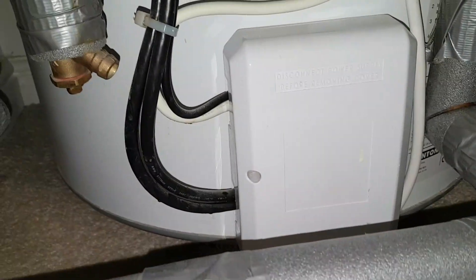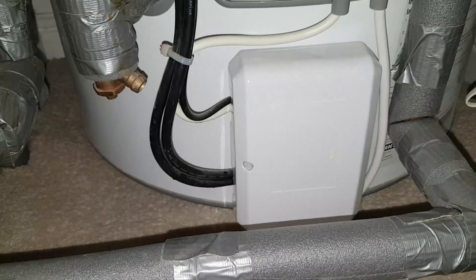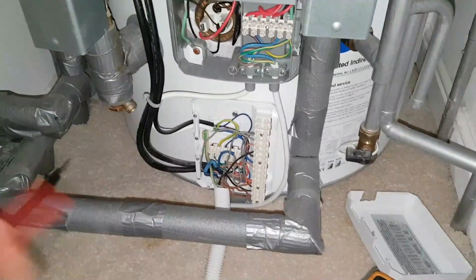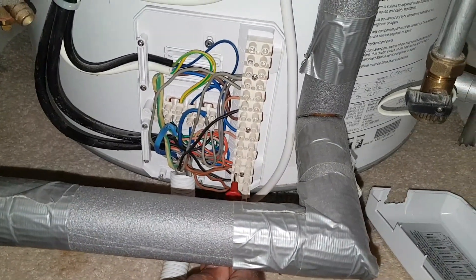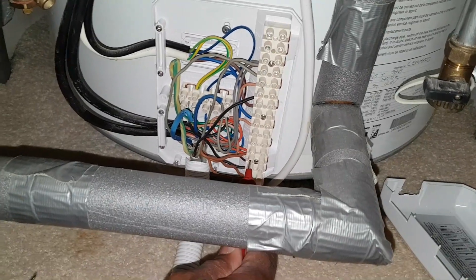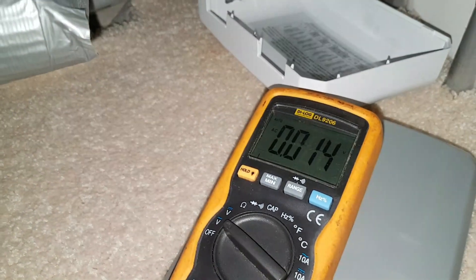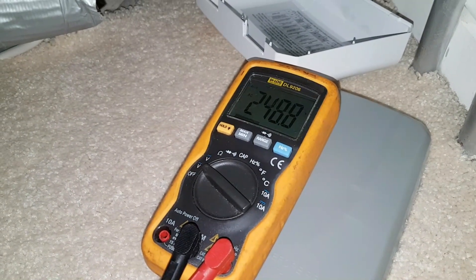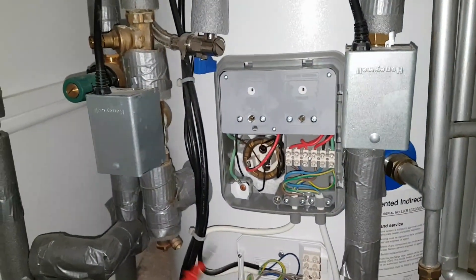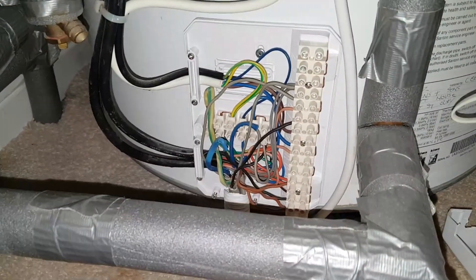The next thing to do is go inside this connection box — that's where the motorized valve is wired up. We're going to check with our multimeter and do some fault finding. I've got the cover off. This connection here is the switch live — this is what should be sending power out to the boiler and the pump. And then there's a neutral. So that's a switch live — and there's nothing coming out there. Now if I look at these grays — these two grays — that's a permanent live, and there is power there. On these zone valves they have a permanent live, ready for when that motor opens — it then sends the signal through the microswitch. But there's nothing activating.